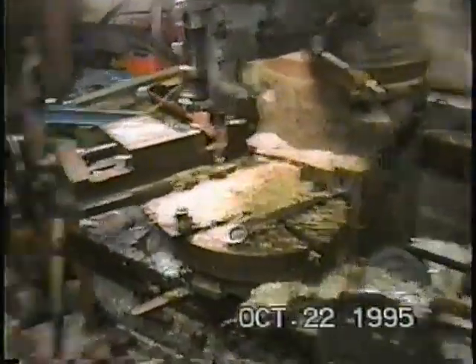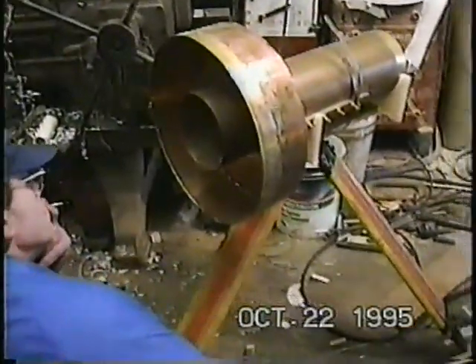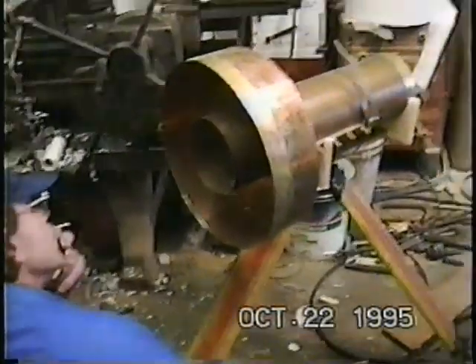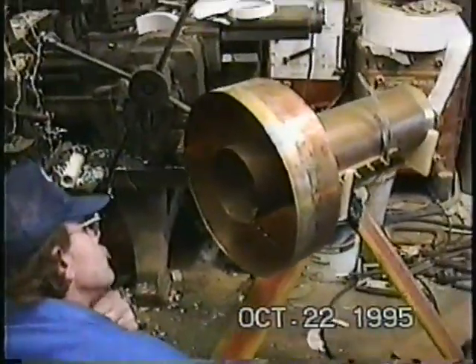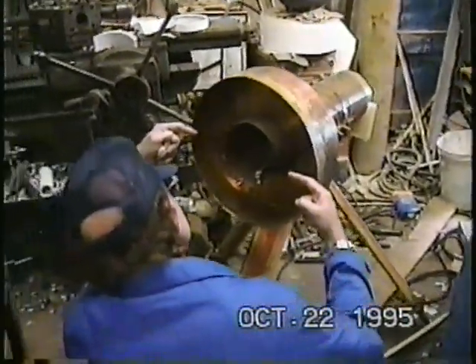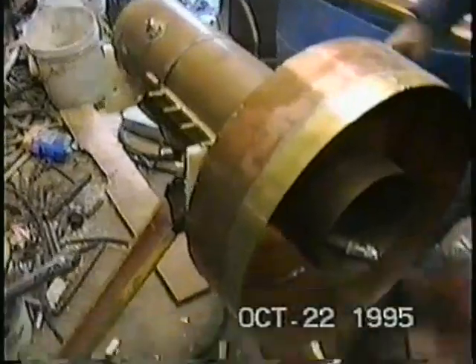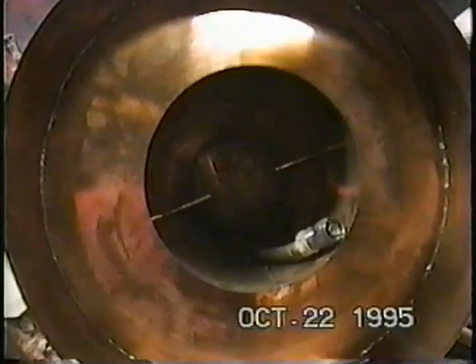How big a piece can you turn on it? So this is one of your pieces? Yeah, that's one of my polarized horns. Will that feed a 10-foot dish adequately? Sure. Like I said, it depends what your F-to-D ratio is. All they're doing is really delay lines — delaying the signal. They're strictly delay lines. Is that what creates the polarization? Right — circular polarization.